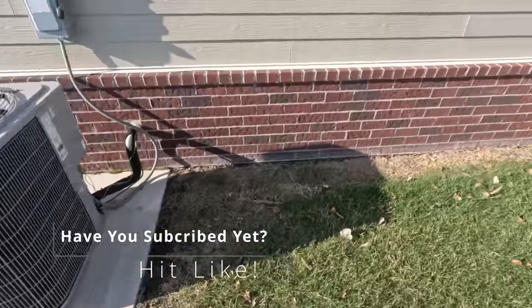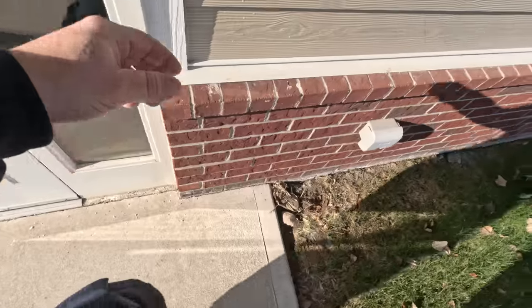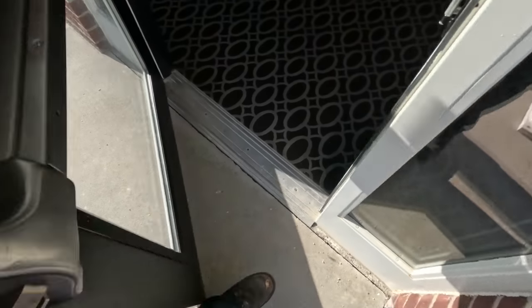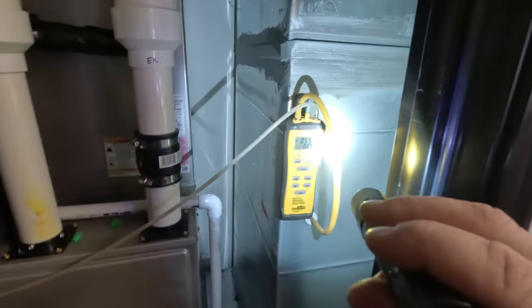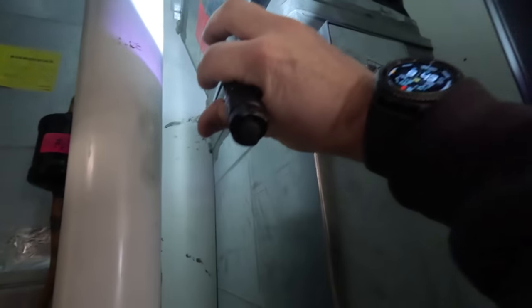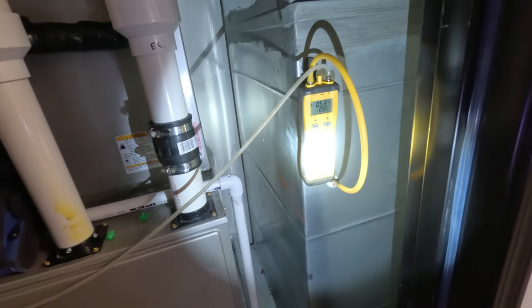Let's go in here and look. I just checked static pressure. They've got fire dampers and it tends to make it difficult. We've checked the filter — filter's fine. We've got a 0.87 static. You've got an inspection damper here for the fire damper up there, and another fire damper inspection port here — both look open. Problem is 0.85, 0.9 — that's pretty high.